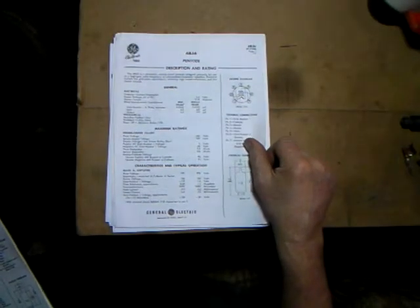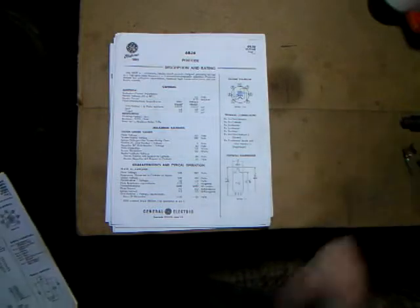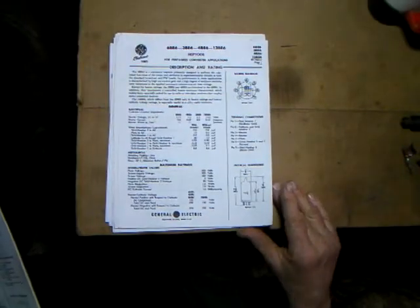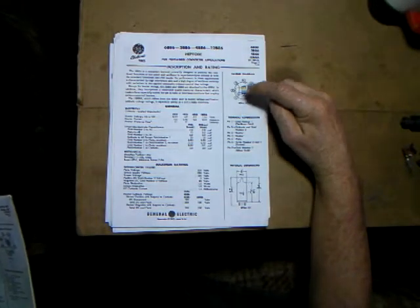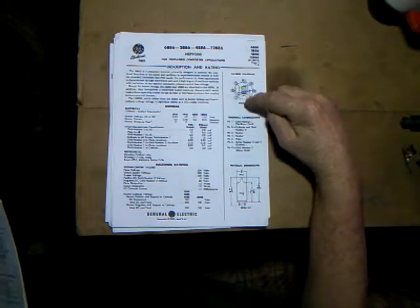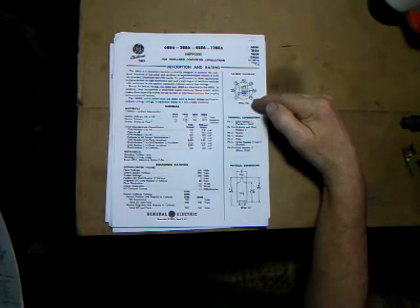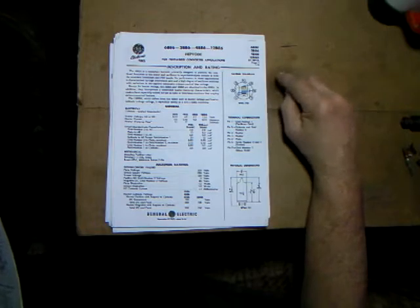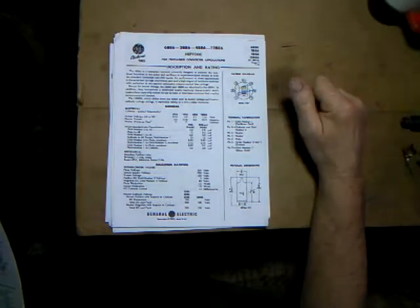These tubes are mostly out of the eye of audiophiles, so unlike the tubes everyone thinks they need to pay $50 or $60 for, you can find these for $2 to $5. There's also the 6BJ6 with cathode on pin 2 and suppressor on pin 7. The one truly special tube is the pentagrid converter - it has extra grids and is used as a mixer tube. This is where you mix your local oscillator with the incoming signal to produce the IF frequency of 455 KC or whatever IF you choose.